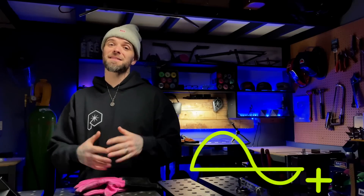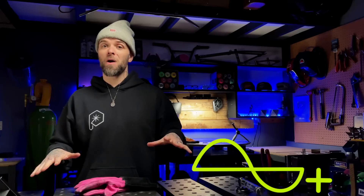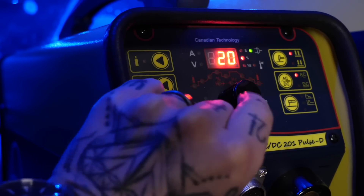This is where the balance setting gets a little tricky. While those settings work well for lower amperage, if you dig in for more heat on a fillet weld, you'll notice the tip of your tungsten begin to flutter and wobble — and that's super annoying. It reduces the accuracy of your arc a lot. So when welding something hotter, I turn the positive side of the cycle down, moving toward an 80/20 split. More negative side means the tungsten becomes more stable, won't flutter, and your tungsten preparation will last way longer.